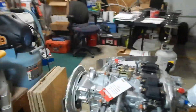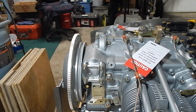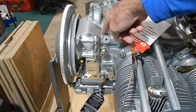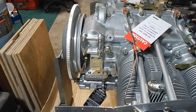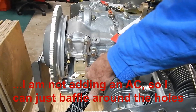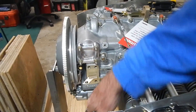So here's the deal on those mounting bolts — those brackets clearly don't work. When you order a constant-speed prop engine option, they also include mounting brackets for an air conditioner compressor, and I guess they include it on both sides so you can choose which side to put it on. Apparently it gets added automatically when you order a constant-speed prop — I guess only people with constant-speed props want air conditioning. Now I'm going to have to fabricate some pieces to fit around here, because the baffling I've got won't fit around these nuts. I talked to Rans and they said to fabricate the right brackets to fit the height, then trim the baffling to fit.